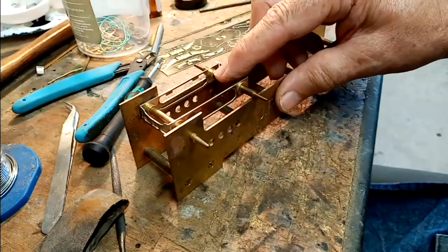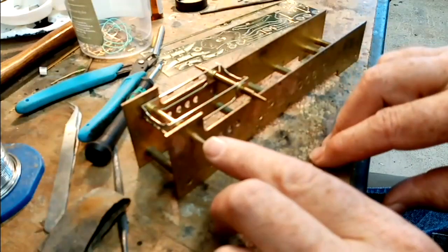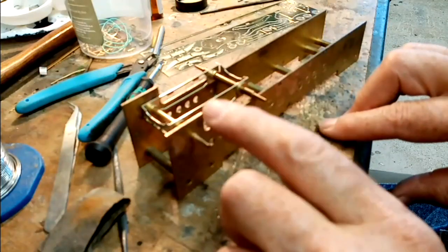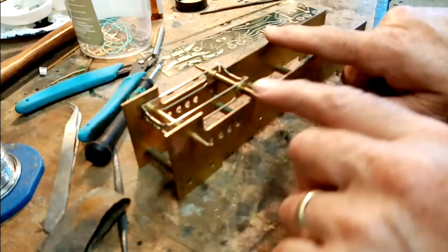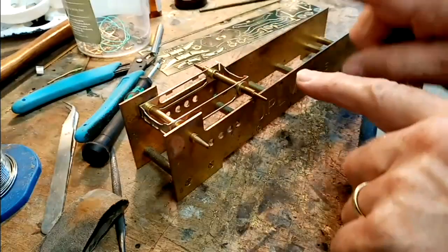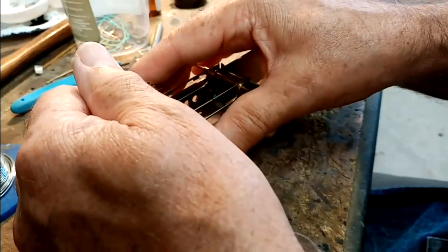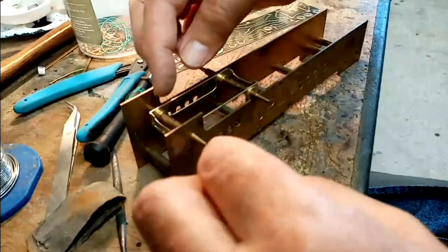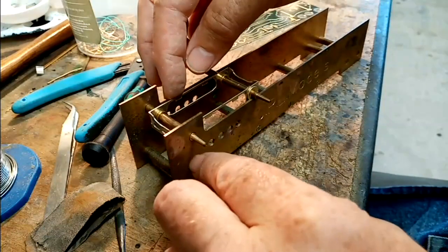And it's the same principle if you're building a rigid chassis, whether it's a four coupled, six coupled or eight coupled. If it's rigid, you can peg up on the back axle, and wherever the other one is, you can ignore the intermediate ones at this stage, but you just feed them through and hold them down, and then you can bank them to one side. So to get it perfectly square, you bank it to the one side. You see that just springing slightly when I release it?